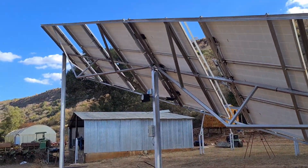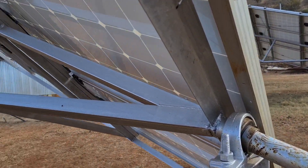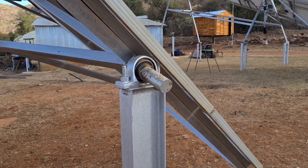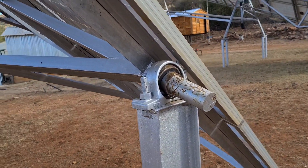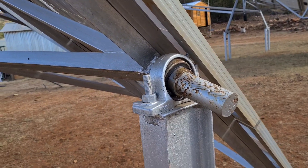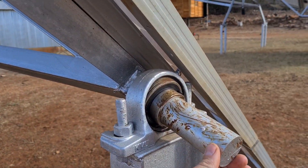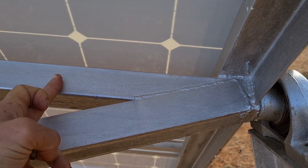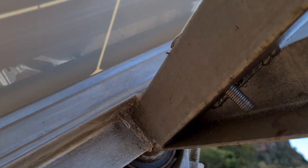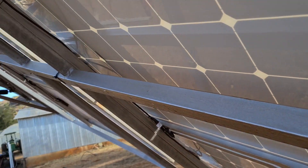I used the same approach as the previous one, but this time I used angle iron instead of square tubing, because water is a problem — with square tubing, if you have a hole and it rains, water gets in and it starts to rust. So this time I used a solid steel shaft going in about 300 to 500mm, with a bolt through it just in case. This section is the only part that is square tubing; the rest is all angle iron.